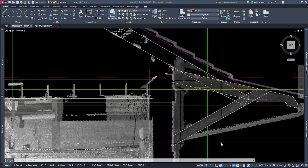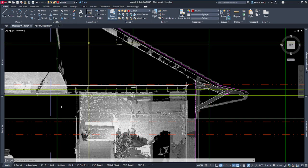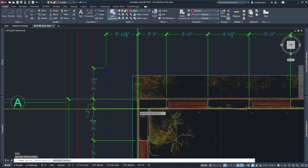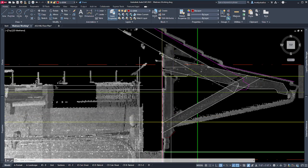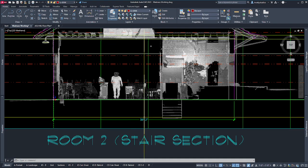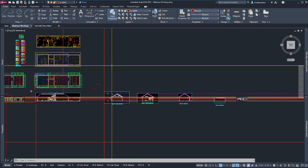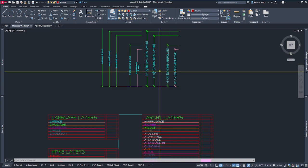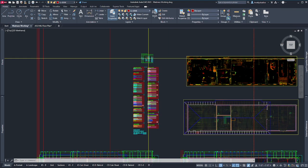Although, oh goodness. Okay, I'm looking at the recap. Let me take you over there. Whoops. Oh, I was on the recap for that whole series. I did a whole bunch of work in AutoCAD. Okay, so here's what I did in AutoCAD. I went through and I looked at the floor plan, and I determined that we did have a 14-inch thick wall. Went back to our working. We're tracing a bunch of this stuff out. So I moved this to meet what was on the floor plan, 38 foot 2 inches. I had used the match properties of one of these to get my tick size correct.